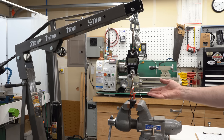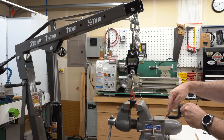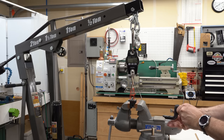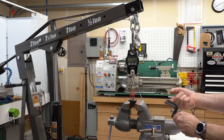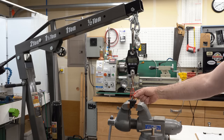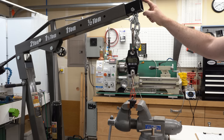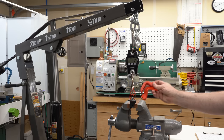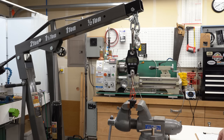Next, we're going to test the ultimate breaking strength of the parts. Instead of pressing down like we did for the deflection test, I have flipped the part over in the vise and we're going to pull up with hydraulics until they break. I've got the paracord doubled up, attached to a crane scale, and the crane scale is on my engine hoist. I've printed two copies of the part in each material and we'll break both and take the average.